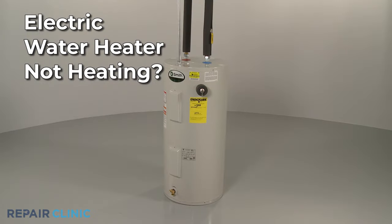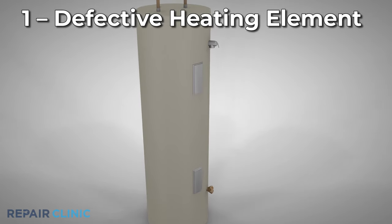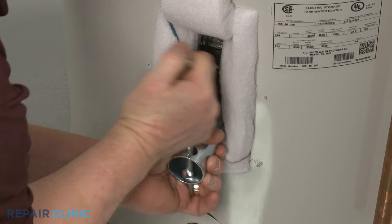If your electric water heater is not heating, here are the top three most probable causes. Most electric water heaters use two heating elements, one near the middle of the tank and one near the bottom, to heat the water. A defective heating element may fail to produce heat.